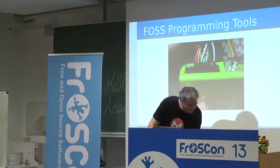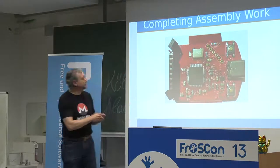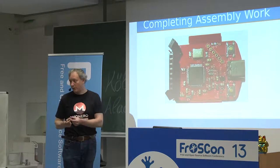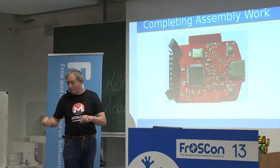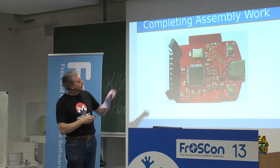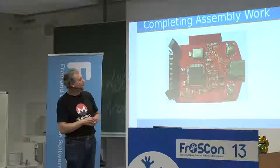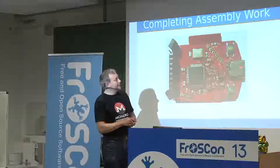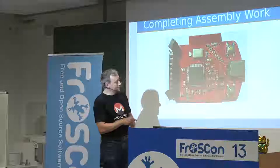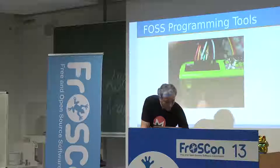If we do go back a minute and look at some of the interfaces, this interface here, the JTAG interface, this is what connects to that green box that I just showed. So we have the green box connected to the laptop or the computer over USB, and then the green box connected to this over a JTAG or any type of contact that has six contacts, or five actually. It needs five, I believe. So in this case, we're providing power through here, but no data, and all of the flashing and programming is going through the JTAG connector there. And that's what we use this for.